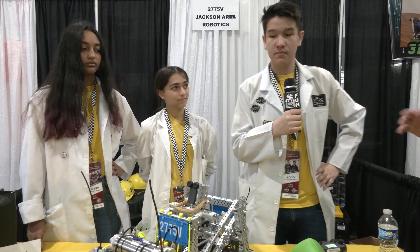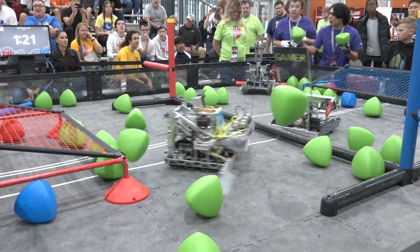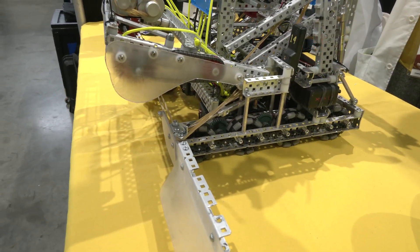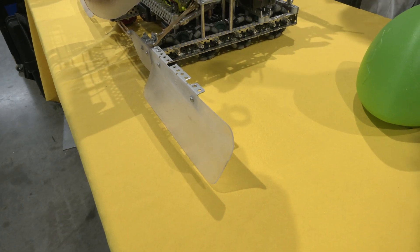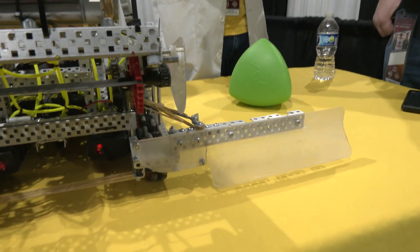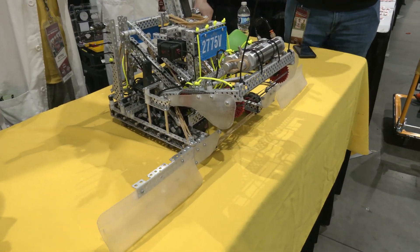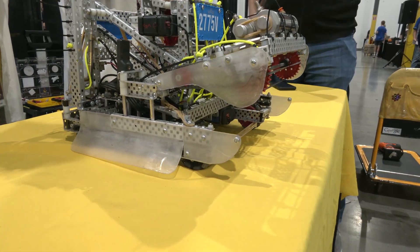The wings on the sides are powered by a piston on each side — pretty simple deployment. They serve two primary functions: great plowing and pushing for skills, autonomous skills driving, and match play. They also have a curve — shaped using a heat gun — which allows pushing tri-balls over the barrier in large groups. This is actually a larger point swing than just moving tri-balls from your zone into your goal, giving a large point advantage early and late. As of recording, the team is currently ranked sixth in the world in skills, and the deployable wings are a big reason why.